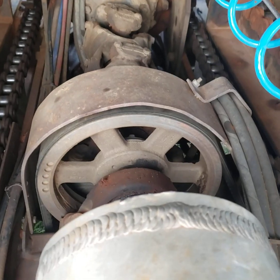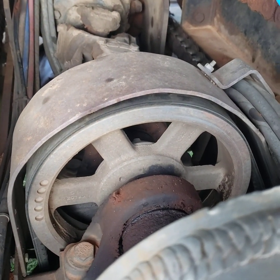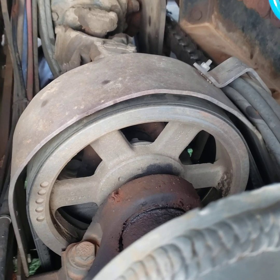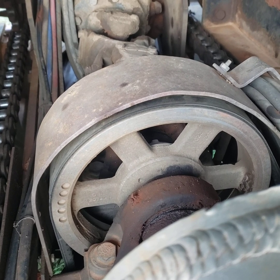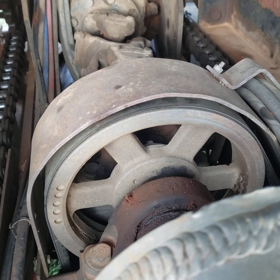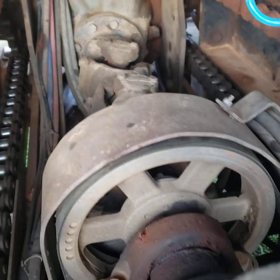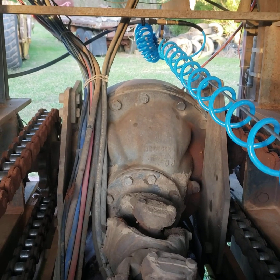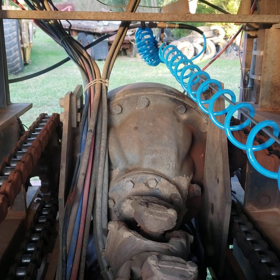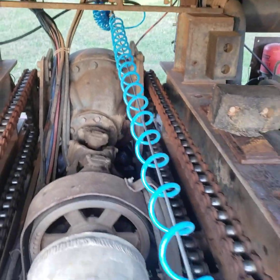Behind the Profab there you see the pulley — that's a 3V belt. That belt is what connects the engine and transmission to the box drive line to run the box back at the end of a pull. And there's a little short stubby driveshaft back here into the SQHD rear end that's between the rails, hooked to the box chains to actually drive it.